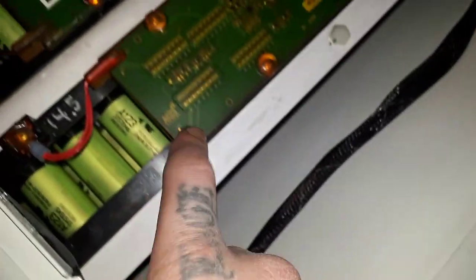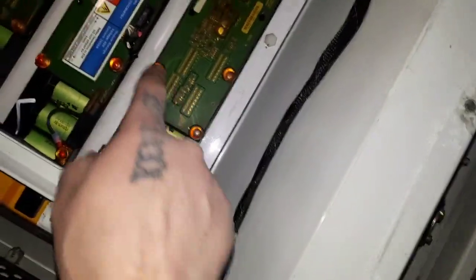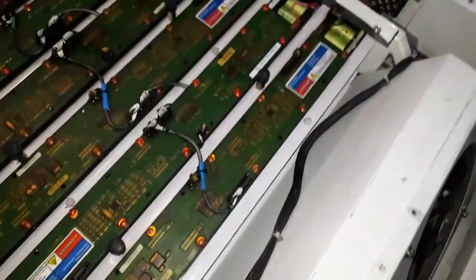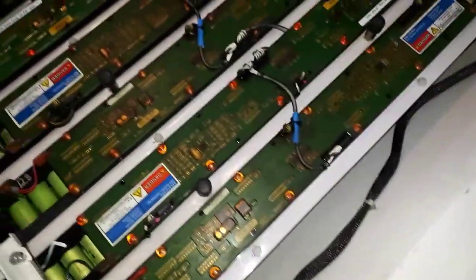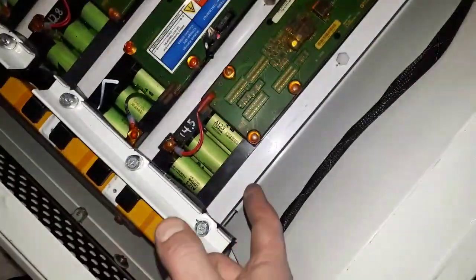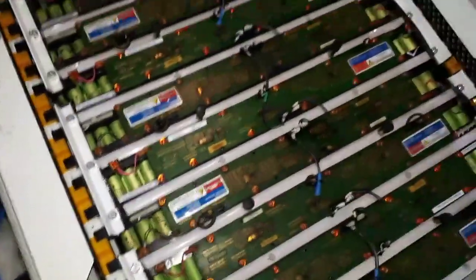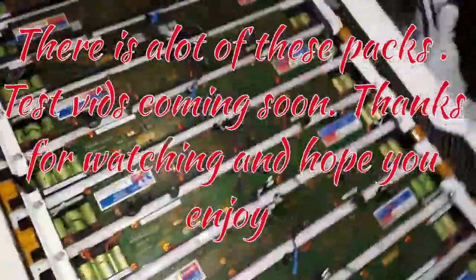Looks like it's going to be fun to come off — I've got super glue on every terminal here. Each one of these is a one in series, so you've got twelve groups. Eight in parallel — eight little batteries in parallel — and then twelve groups of eight gives you ninety-six cells. Total here is like fifteen hundred and thirty cells, and I've got times ten, so I have about fifteen thousand cells going. It's pretty hectic.